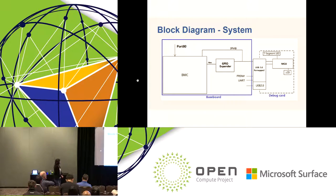This is a system-level block diagram. On the right side is the debug card and on the left side is the baseboard. The debug card plugs into the baseboard through the USB 3 interface — the USB 3 portions have been remapped while USB 2.0 is still supported. The remapped USB 3 interface now carries IPMB, I2C bus, the present pin, and UART. On the baseboard side, there are two key chips: the BMC chip and a GPIO expander. The GPIO expander delivers the port 80 hex code to the microcontroller on the debug card via I2C, and the BMC communicates with the debug card microcontroller to deliver debug messages to be shown on the LCD panel.